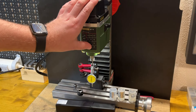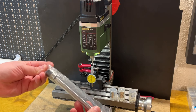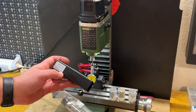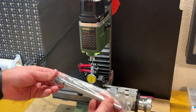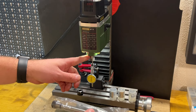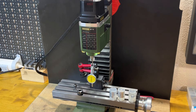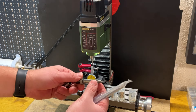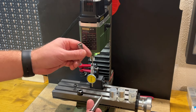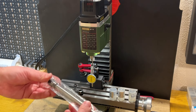The assembly will be a little bit different compared to what I have now. This is a precision spindle — the manufacturer says there is a runout of 0.003 millimeters, though I'm not sure I fully trust that. This spindle has a 10 millimeter shaft; currently I'm using an 8 millimeter shaft, so I will replace the bearings and the shaft. I also have a spacer from the original spindle that sits between the bearings, which I can reuse.